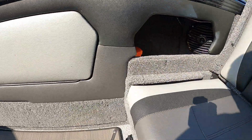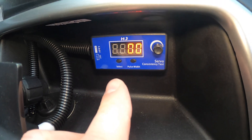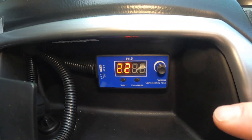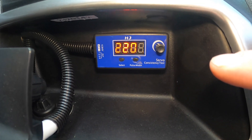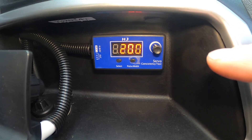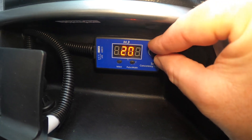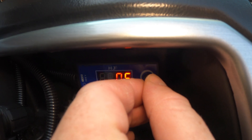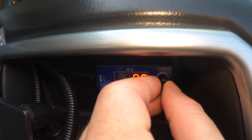At the helm to control the throttle, I bought one of these servo motor testers. It has three different modes — this is important to know — but the mode you need is the default setting mode. When you turn it on it's set at default, and all you need to do to adjust the throttle is just turn the little dial and you can increase the throttle setting of the kicker motor.